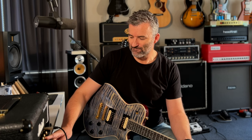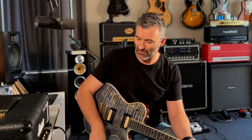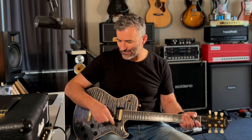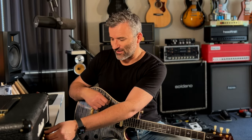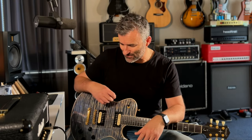In the middle position we have the standard 10K cold clipper. Then to the left we've got a reducing cathode resistor which gives more gain. And then all the way to the right is the standard Marshall hot rod second gain stage. The last thing we have is a push-pull — this gain pot has been changed to a push-pull arrangement. The push-pull simply brings the bright cap in and out, enabling you to get that JCM 800 2203/2204 gnarly bright cap sound, or you can push it in and the bright cap will be eliminated.